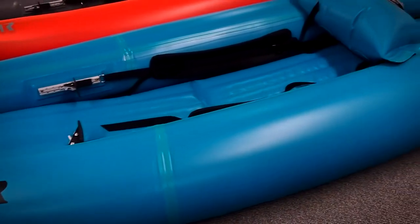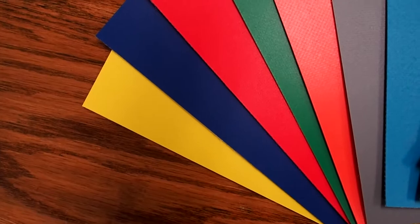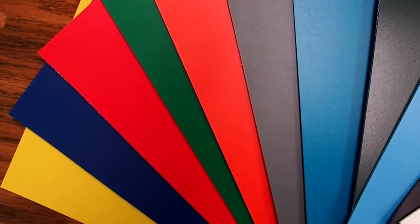Can you tell us about Sotar specifically — how is it different from other manufacturers, and about the materials you're using? We're using a very high-grade polyurethane-coated polyester base material — very high strength, very low stretch. It's really important that when you inflate the boat, it remains rigid as you use it. We picked polyester because a lot of people use nylon, and nylon is very hydrophilic, so it tends to lose strength once the base material gets wet. If you have a boat over a long period of time, it can get kind of sloppy over the years. Urethane has better abrasion resistance, handles puncture better, and holds air better. It's a bit more expensive, but you get what you pay for.